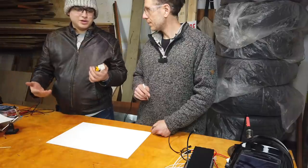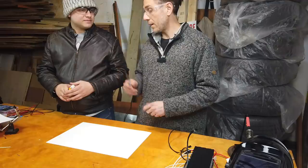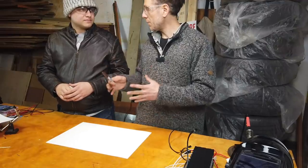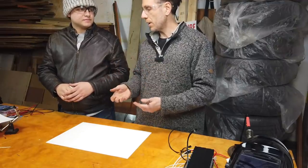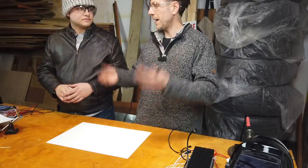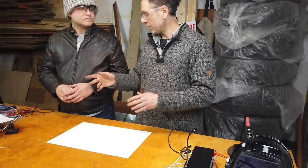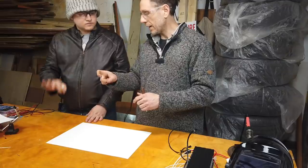So why did you bring such a complicated switch? Why don't we just use a light switch? Okay, so you can't just do on and off, because you're doing a motor that's spinning a blade. Now, let's say you're mowing the lawn and something happens to you, you pass out or whatever, or you gotta run away from it for a second or you lose it. When you let go of the switch you're holding, that means we have to stop that motor right away because we don't know whether it's falling down a hill. It's called a fail safe. Actually, better would be a dead man switch.